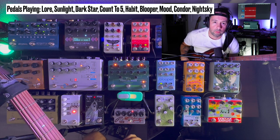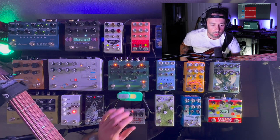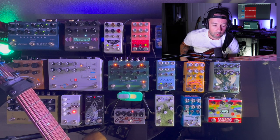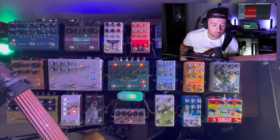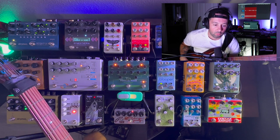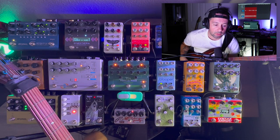I'm going to make a swell loop with Ditto times two. But Ditto times two is last in chain, so it will record all three loops as soon as I hit record on it, which I don't want. If it records the loops while I'm playing and then I stop the recording, it'll just replay that portion of all three loops over and over, and it'll just become a jumbled up mess because it'll play that recorded portion along with the actual three loops, and it'll get mixed together and not sound as good.